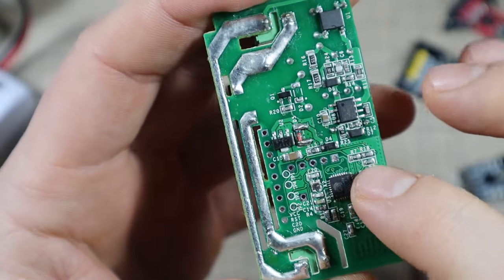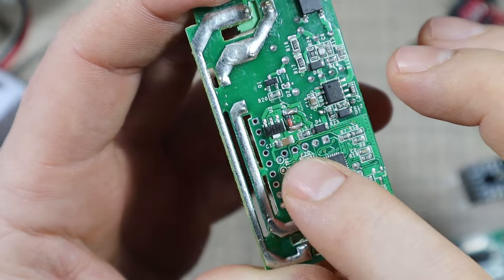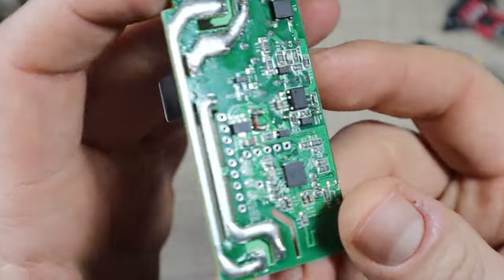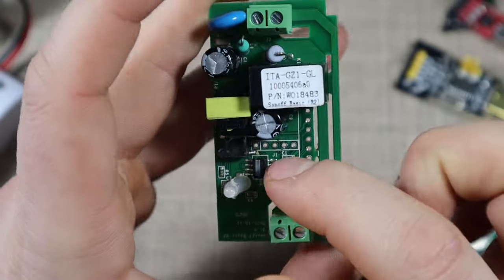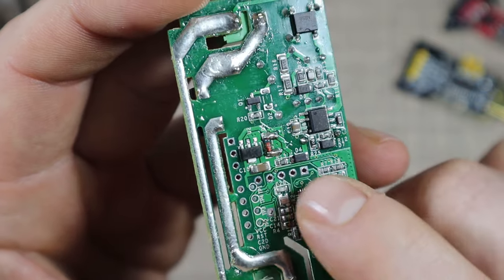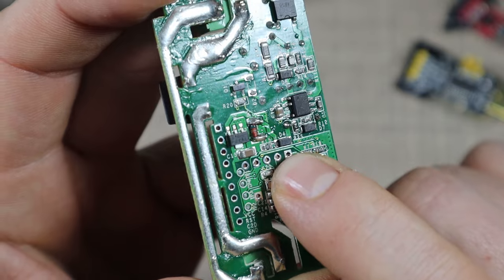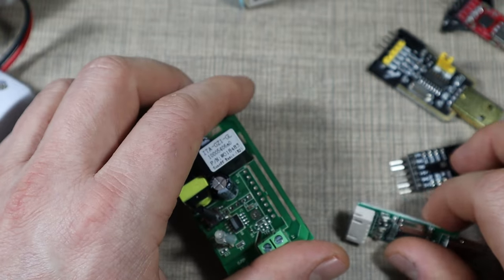On some of the boards I've seen online, the pins left on the PCB are actually marked with what they're supposed to do, but unfortunately on mine there are no markings, which indicates to me that this might be a clone — but still it works the same way. I was able to figure out that the far right pin, or far left if seen from the top, is VCC, next one is RX, then TX, and the fourth one is ground. So we need to connect the USB-to-serial such that VCC and ground are on the outside, with TX next to VCC and RX next to ground.